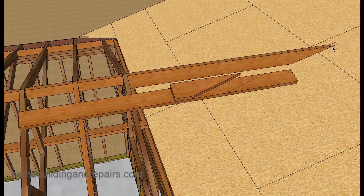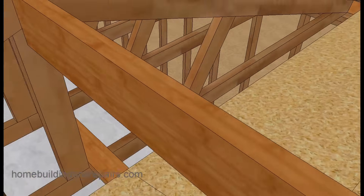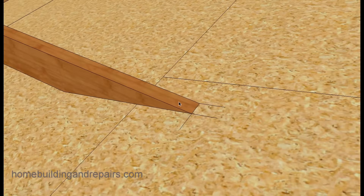Here the ridge is already installed and lined up with the marks. You're simply going to measure from the reference point to the mark you made, then transfer those measurements over to the ridge board you're going to cut, and use your pattern to create the cut line. You can toenail it or end-nail it in. A lot of times you won't have backing underneath — you might have a rafter on the side or simply toenail it into the roof sheathing.